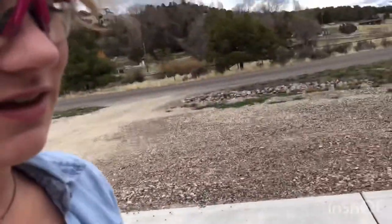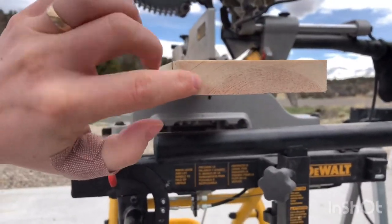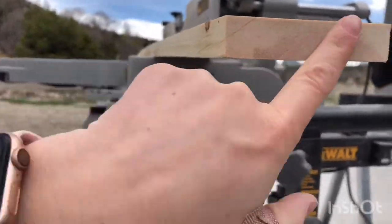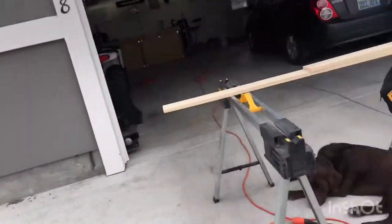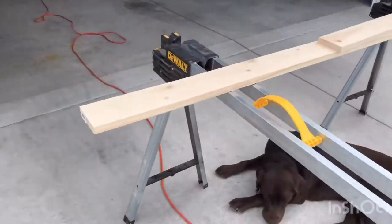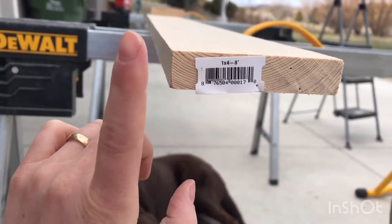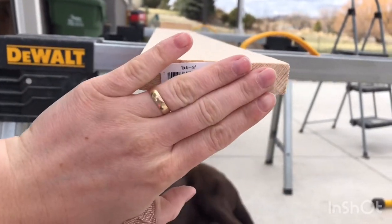When I first started woodworking, this is something I learned that helped me quite a bit. If you look at this piece, it's been cut already and it's a nice, smooth, very straight piece. On the other side, you probably can't tell, but it is a rough-sawn texture — this is what came factory grade. Like this other piece, there's a ton of texture, and there's still a staple on it. Definitely want to take that staple off before you run it through the saw. Don't leave it rough-sawn when you're trying to build something like a blanket ladder where pieces have to butt up against each other nicely. It's something I had to learn the hard way — so if you're brand new to this, cut off the rough-sawn edge.